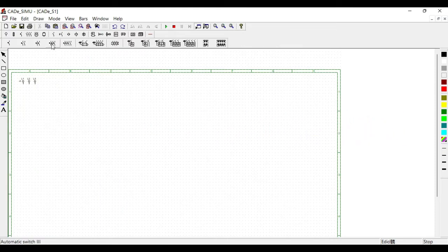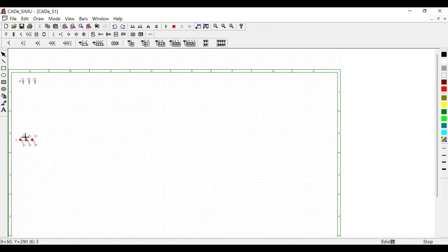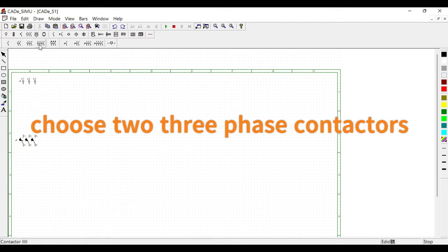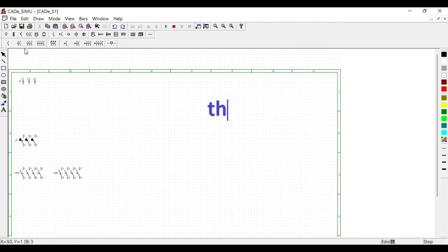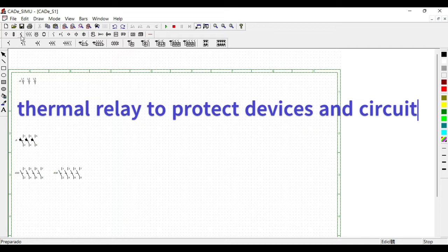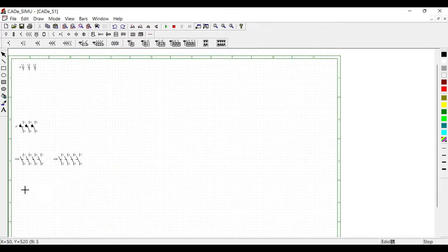Click to choose one three-phase breaker. Choose two new relays which are used to change the motor's rotation. Now get a thermal relay. This thermal relay will protect the motors when there is overcurrent running through the system. Supposing that there is overcurrent in the system, after a certain time, the internal heat will trigger the protection mechanism in the relay. The relay will be turned off quickly so there is no more voltage applying on the motors.